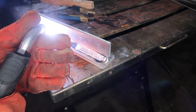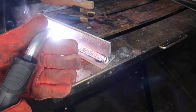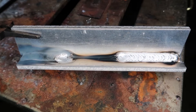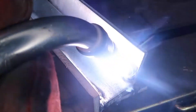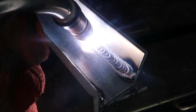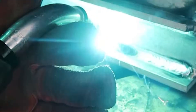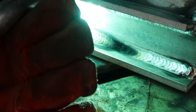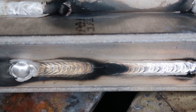Using 4043, here's a push angle with a little weave pattern — going into the weld joint and back with a small tight pattern to get a dime stack. Now this next weld I'm running a drag angle with a similar weave pattern, back and forth into the joint. Look at both welds: you can see soot on the drag and no soot on the push, so always push. With 5356, the arc is a bit sootier because it has magnesium and the arc appears green compared to 4043, which burns bright and clean because of its silicon content.